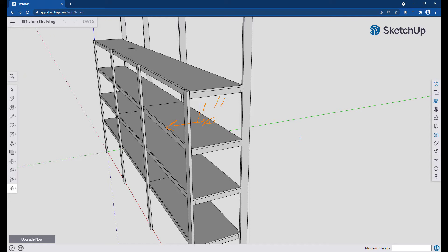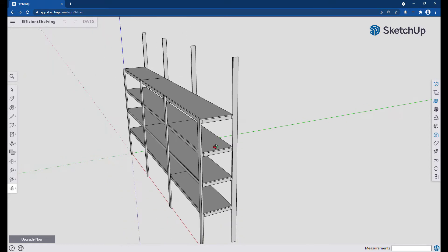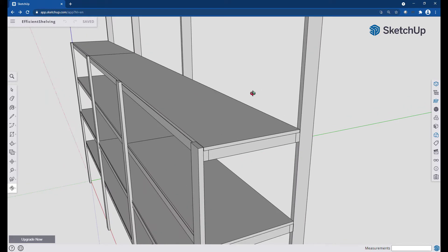These are some of the things you want to think about as you're laying out your project. If you want to give yourself a little help when you're ripping the plywood, you can try to rip exactly at 16 inches, but you have to take into account the kerf — the width of the blade — as you're ripping these sheets. So what I would do is set my target width to 15 and 7 eighths, maybe 15 and 3 quarters, and give yourself a little bit of wiggle room. That way, if you build this shelf such that the distance is 16 inches and you lay that piece of plywood down, you have a little bit of tolerance. If you have really long runs and you're doing this with a circular saw and a straight-edge guide, you want to be as careful as you can and give yourself a little wiggle room. That's it for the design part — now let's look at how we actually built these things.